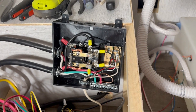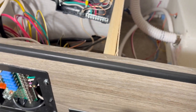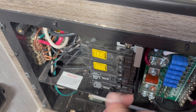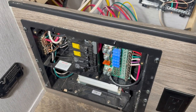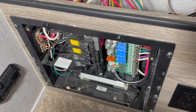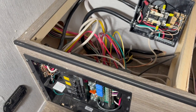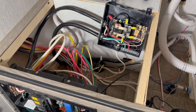When I run the inverter, I turn it on using a switch I'll mount nearby, then come over and flip off the converter's breaker — that way I'm running off the battery at 110 volts. When I want to switch to shore power, I just plug it in, the switch transfers automatically, then I turn the converter back on to charge the battery and provide 12 volts off shore power.